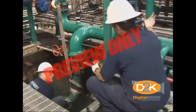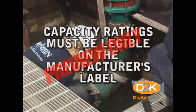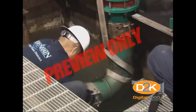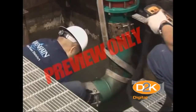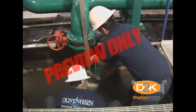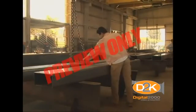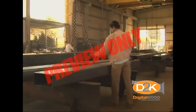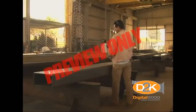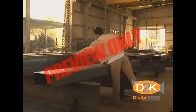Check the condition and capacity of nylon or synthetic web slings. Capacity ratings must be legible on the manufacturer's label. The capacity of the sling being used must be adequate for the load and attachment method. Replace slings immediately if excessive wear is evident. Slings, load chains, and other lifting devices must be fully and securely seated in the hook before moving a load. Remove slack from the sling, chain, or cable before lifting a load.